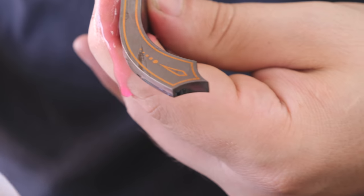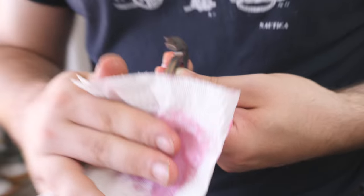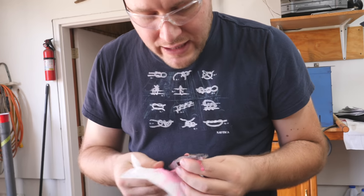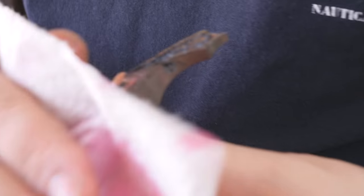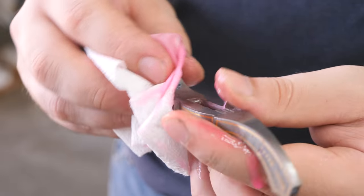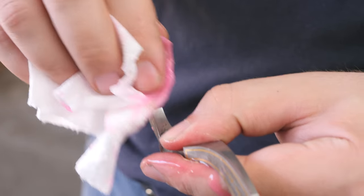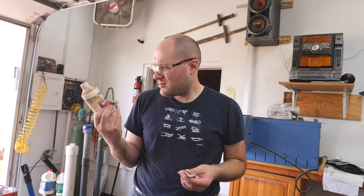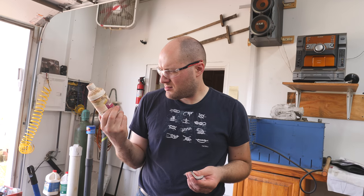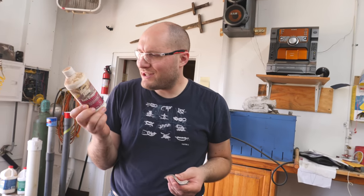This is how I get the French gray look on my engraving. You blue it and then you remove the bluing with this rust remover and then it gives a nice gray finish. It doesn't look good on a large surface, but on little engraving areas, it looks really cool. So that saves a whole bunch of sanding because it would take a lot of sanding to get all the bluing off. You think it's really bad for me to get on my hands every once in a while? Probably bad for your body. Your kidneys will fix it, your liver. It says to wear rubber gloves when in use.